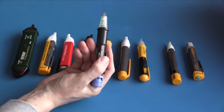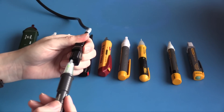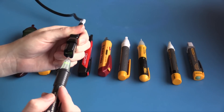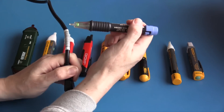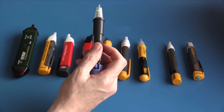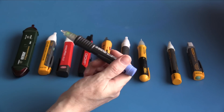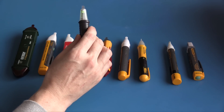This is the Hioki 3120. It can be turned on and off using the cap. It glows green to indicate the unit is on and operating, but it's a little dim and hard to see. On the live conductor it indicates; on neutral it is also indicating — as with the Ideal unit, this is a little bit too sensitive, as it indicated on the neutral.